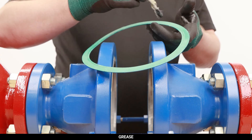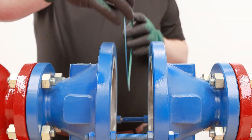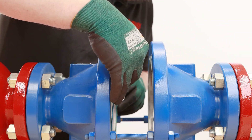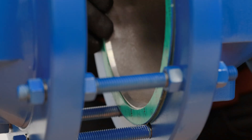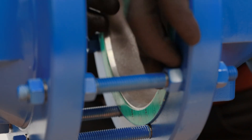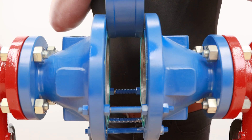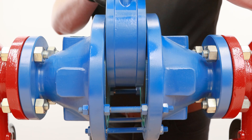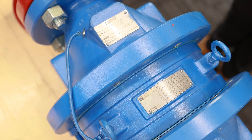Now we will assemble the housing, bases, and gaskets. First, install the gaskets. Add a small amount of grease to the textured side of the gasket face to make installation easier. Place the gaskets on the flanges, centered with the bolt circles or counterbores if present. Next, place the flame bank assembly into position. Ensure the lifting handles or lifting eyes are on the top. The flame bank assembly is bi-directional and can be installed either way — there's not a front or a back.